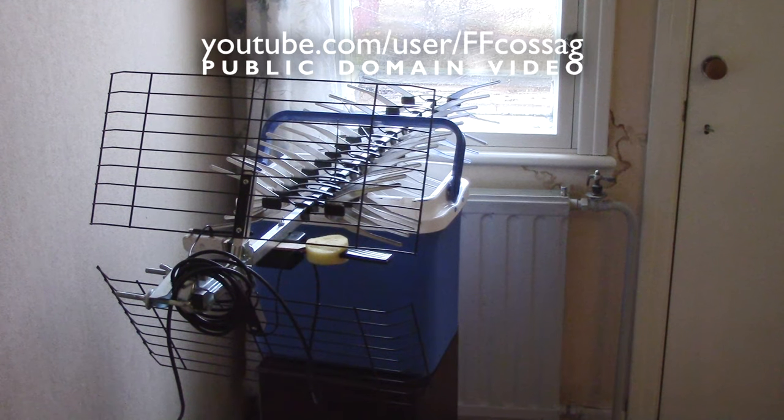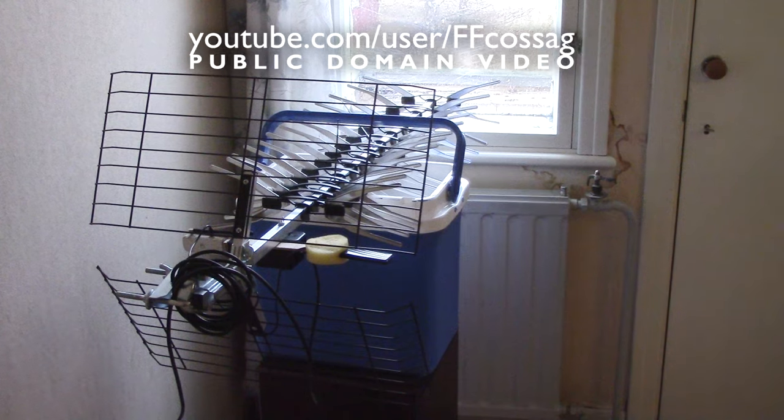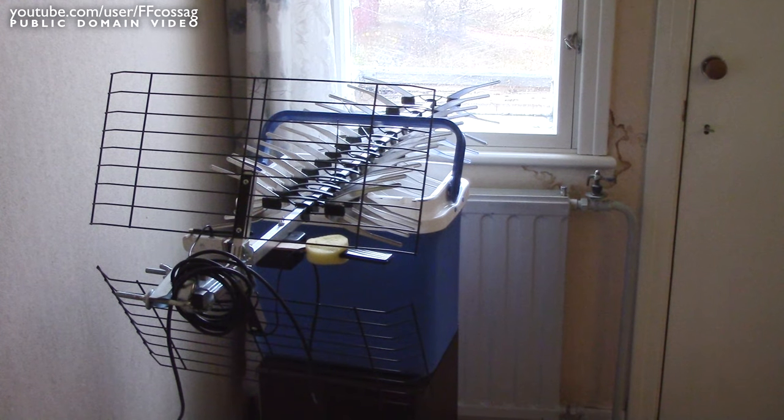If you don't know about how TV antennas work, the basic is that all those little pointy bits you see mounted to the stalk serve to amplify a signal coming from a very particular direction and focus that signal onto a single point where the receiver module sits — in this case my 4G modem. The reason they're able to amplify a signal in this manner is because they sacrifice omnidirectionality for receiving a signal coming from a single point in the distance.